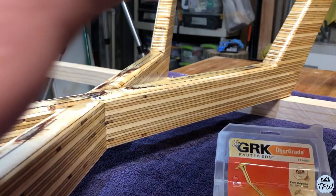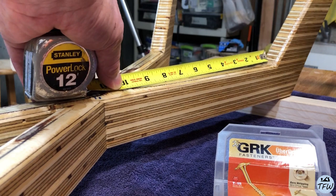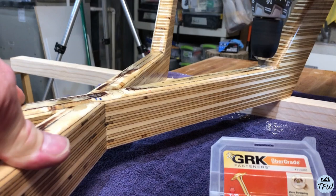All right, we're almost done. I'm just putting some centerline marks on the legs and measuring out some holes so that I can put in these cabinet screws. These are going to be great to attach the legs to the tabletop — nice and solid, and if I ever need to take it apart it'll be easy. For that matter, 10 years from now I could change the leg design and it'll be easy to remove them.